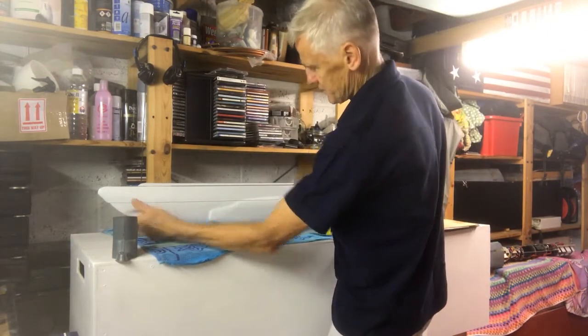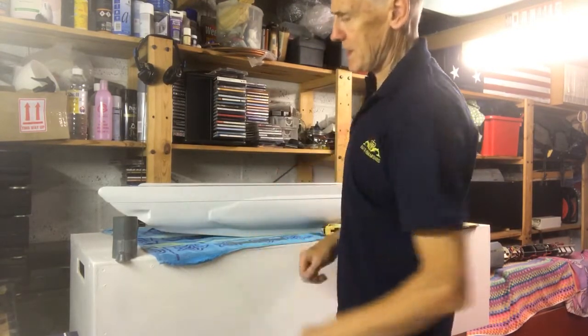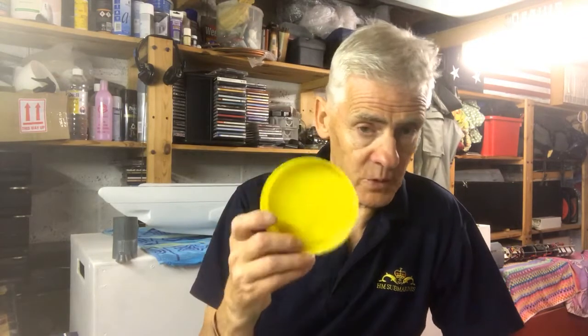So it looks really nice, and in which case you might have to do a little bit of filling in places to get that really nice. And I suggest that if you're going to use a filler, you could use something like P38, which unfortunately is porous. It's okay to use, but there's always a case that it can absorb some water. So if you use something like this marine filler by Plastic Padding, this is really good stuff. And you can fix a lot of the fittings inside with this because it's really hard stuff, and it works very well, and it doesn't absorb any water and end up cracking off. So that's something you may well get from your local shop, possibly. I've got mine online, which is a little bit cheaper.